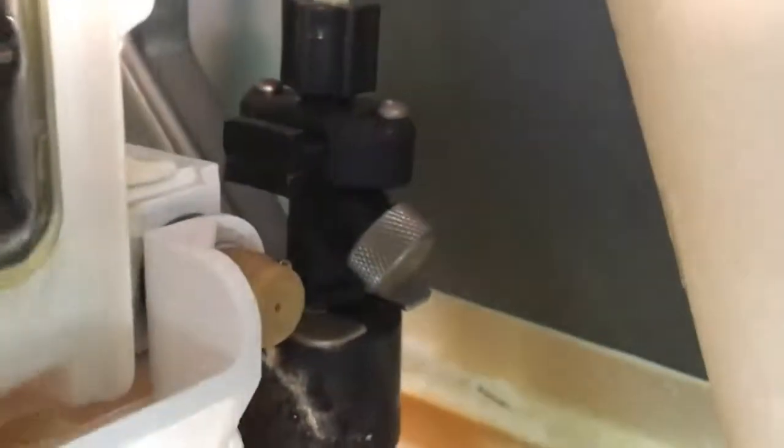Now you can see that the ice is starting to freeze over so that you cannot see the back. Well, you can still see it because ice is transparent, but you wouldn't be able to touch the matrix anymore because it's completely filled over with ice almost, except for on the top row. The top row seems to be taking a little longer. Here is the pump that pumps the water from the tray to the top of the ice matrix right there. That little thing right there is the float that keeps the tray from overflowing. That right there is the valve where the water comes out.